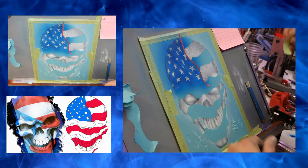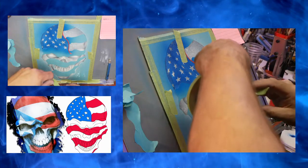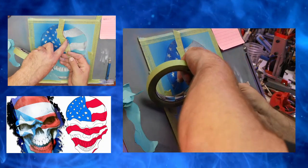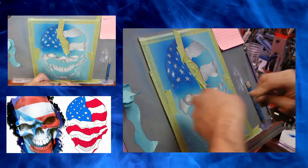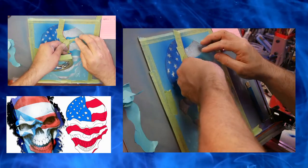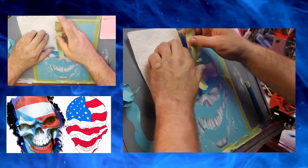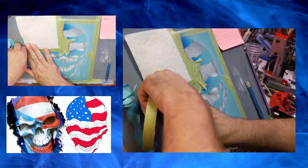I'm rolling. Yeah, the GS24. I have the GX, which is the model before the GS. And what's nice about the GS, the GS cuts on the outside of the roller, so you can get a full 24-inch cut, whereas with the old ones, you had to lose a quarter inch off each side for the rollers. So the GS definitely was a step up, and it's super exact. Now, I did hear the only thing they did is the gears aren't as super strong. But I don't know, I've heard mixed reviews. The GX was such an old-school beast, it's like a tank. But I love the GS24. Now they have a newer one.